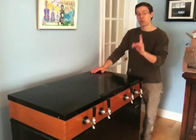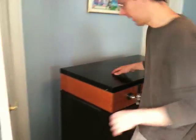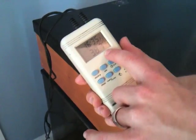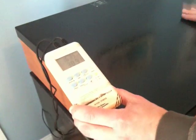This freezer was bought new. One thing I forgot to mention about using a freezer is you do need an additional piece of equipment: a temperature controller, because this thing wants to freeze. What I have is a temperature controller unit where I can dial in the exact temperature I want. I plug the freezer into one end and plug the controller into the wall. There's a temperature probe that sits inside, and this regulates when the freezer turns on and off to maintain the right temperature.